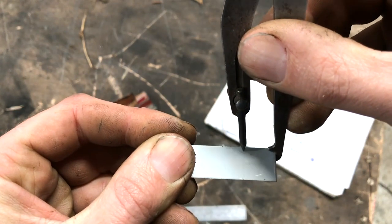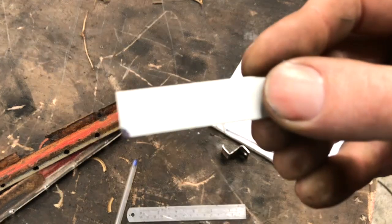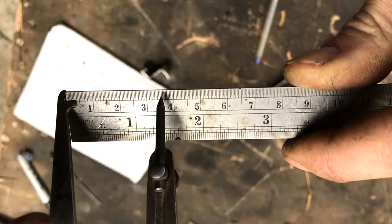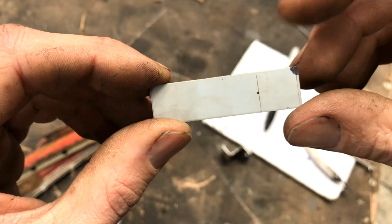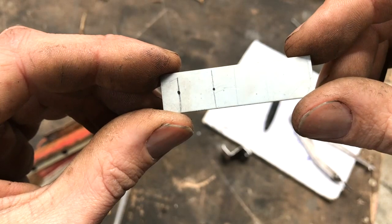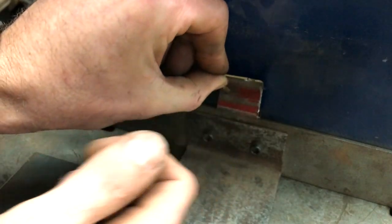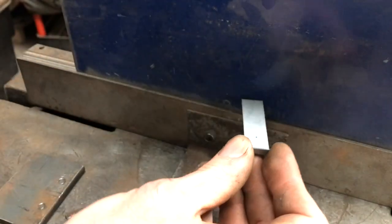The smallest width fold on this part is 3mm long. I can't produce a 3mm fold with my tooling so I have left it 5mm and will cut it off afterwards. I've marked all the lines on a test sample and marked a dot on each line just to make sure I fold on the scribed line and not another random line. The order in which I fold this part is important as tool clearance will prevent folding if the wrong order is selected — I have to fold the 5mm section first in this case.